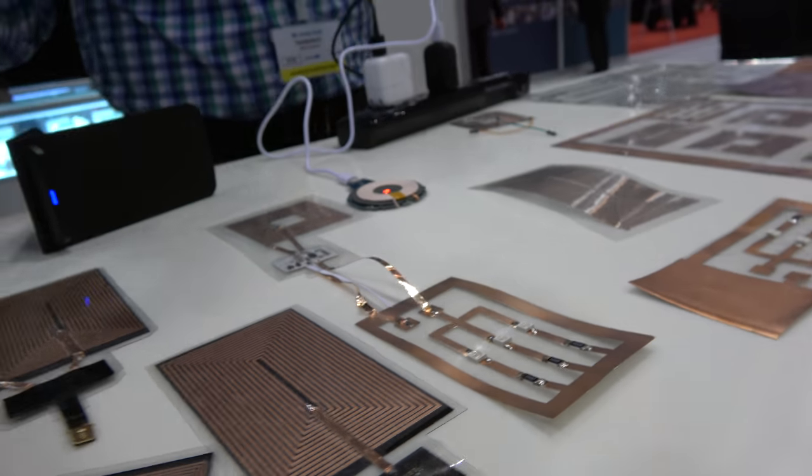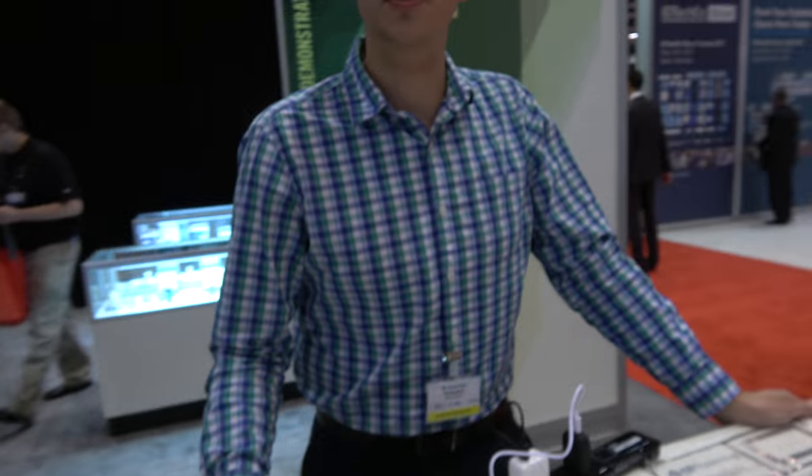The advantage is a number of things. First and foremost, it saves money on your devices. The other is to shorten your lead times. A lot of PCB shops have multiple steps needed to do the process. So if you compress it to a single step with DP patterning, you can make parts within half an hour or less. And you can do these parts not just in small volumes, but in several hundred meters to kilometers of material.